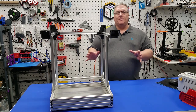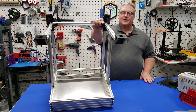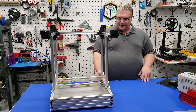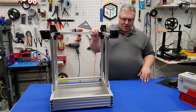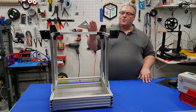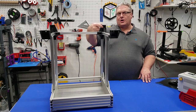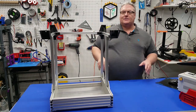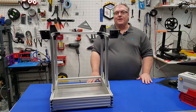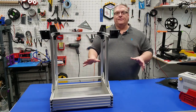I think we had a really good build for our first day here. We have the frame fully assembled — we've got a very sizable electronics enclosure included, and we owe all that to the 2080 extrusion. All of our TPU feet are in place, giving a good solid base. We've got the rear towers now installed — those are for the idler bearings, which we'll install when we get to the carriage. We also put the stepper mounts in today. This looks like a 3D printer, so we've made a lot of really good progress. Once you finish the frame assembly, go back and make sure all of the screws are tight.